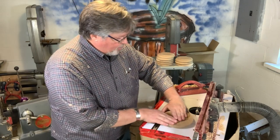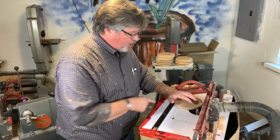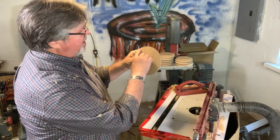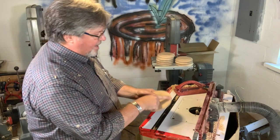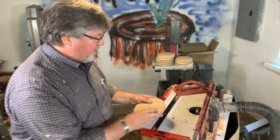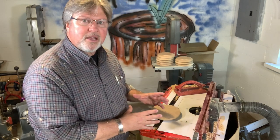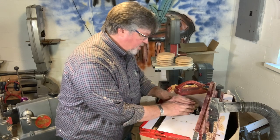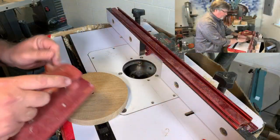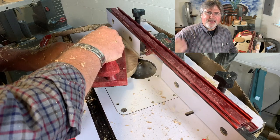Again, I'm routing along, and then I decide, okay, I'm at the point where I want to stop. I visually look at a spot on the grain when I pull away, because I'm going to want to make sure, if I've routed to here, that when I come back into the bit, I begin on a section of this where I've already routed. That way I'm not having to repeatedly plunge into that solid piece of stock. So again, I go maybe around a corner, stop, reposition myself, overlapping where I've already routed, do a little bit more. With a circle, you can go around again. Well, really anything. You can route again and again and again.